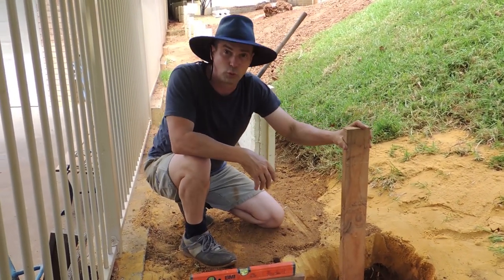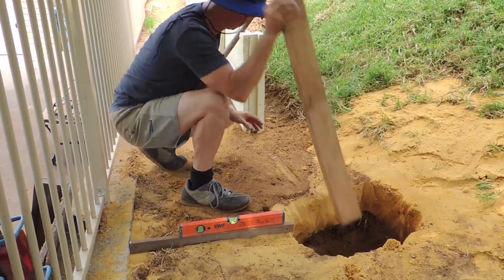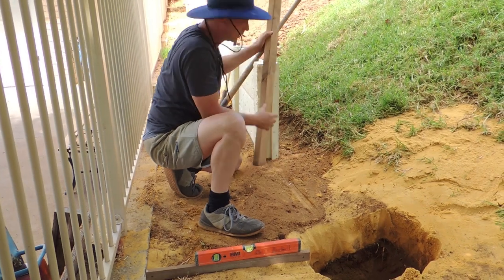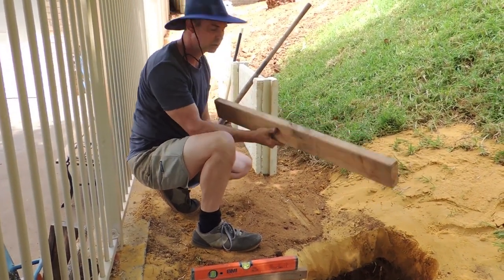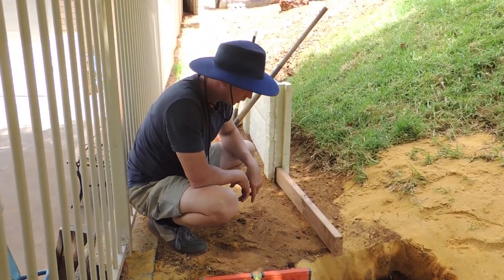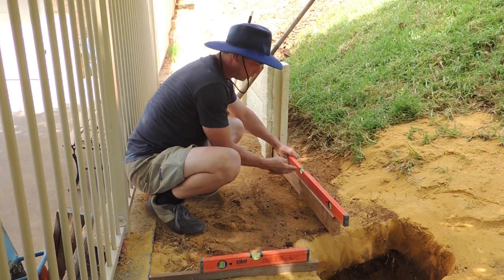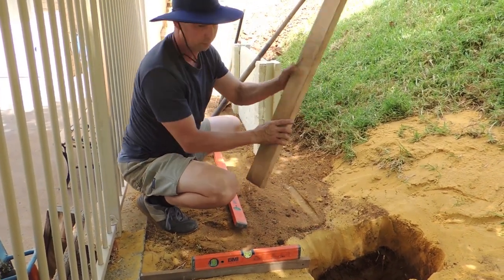We're saving the board and I'm just digging the hole a bit deeper. I used that bit of dirt to bring this level up correctly. You can see I've measured down and made a pencil mark at about 600. I've made it level to the top of that. I don't even need the tape measure now because the piece of wood tells it all. So that's our height — we know what our length is. That's our post length — we know that that's correct.